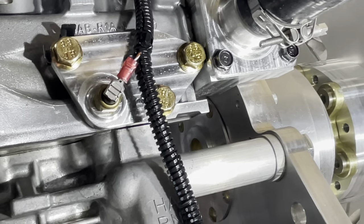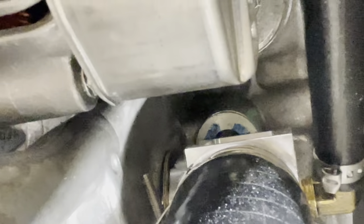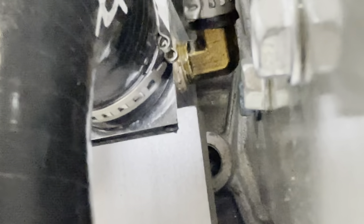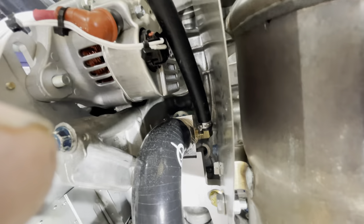In the car there's a tube between this location behind the exhaust and up in here — all been removed and simplified. We have the hot side and the cool side as two separate machined pieces. The piece sits in there with a little retaining ring on one side to keep it from going too far in — you don't want it hitting the pump impeller. Then a notch in the aluminum engine mounting bracket holds it so it can't come back out. This gives it a little free-floating mounting so the two O-rings can self-center in the bore and keep it from leaking.